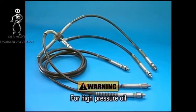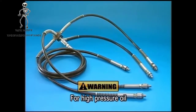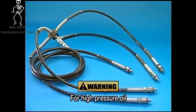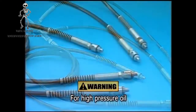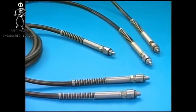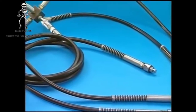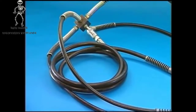A leak of hydraulic fluid while using the hydraulic jack could lead to the spout of the fluid under high pressure and result in physical injury. Therefore, don't use the hydraulic jack with a rubber hose having a flaw or an oil leaking portion. Furthermore, don't burden the outside of the rubber hose and don't bring your face close to the jack or branch pipe during the procedure.